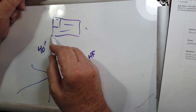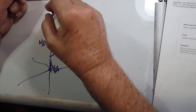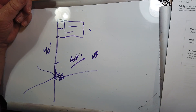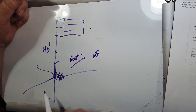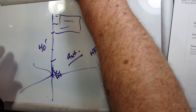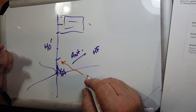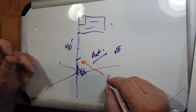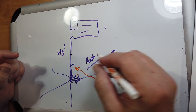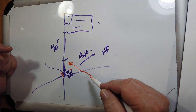Hers is a telescoping antenna — it comes at, say, 10 feet long, telescopes out to 40 feet, locks into place, and you've got your flagpole. Now, there are two ways of interpreting your question. One is: can I use this as a two-meter antenna? Can you load it up on two meters? You can try, but you'll get a very strange pattern and the tuner may not tune that high — that's out of range for most tuners. So let's discard using the flagpole itself as the antenna.